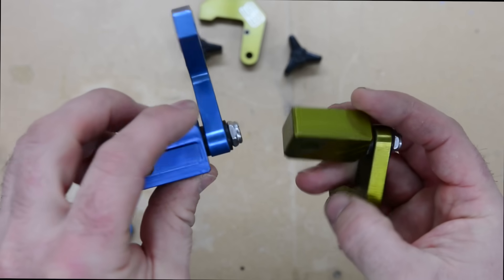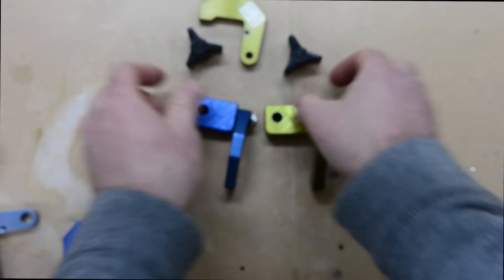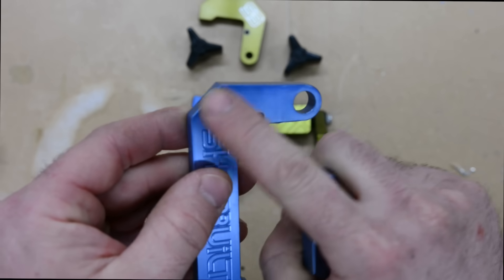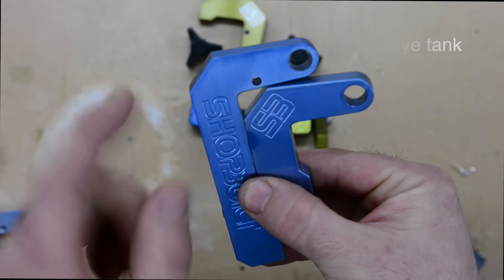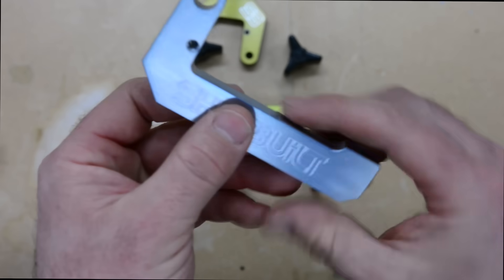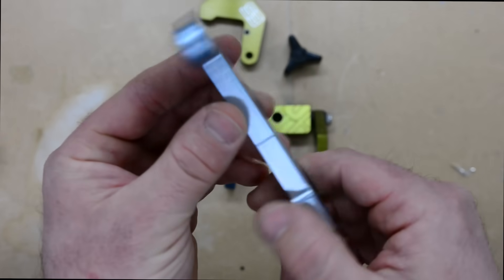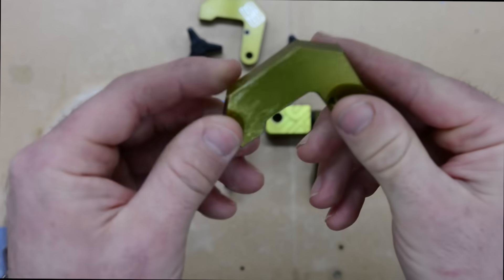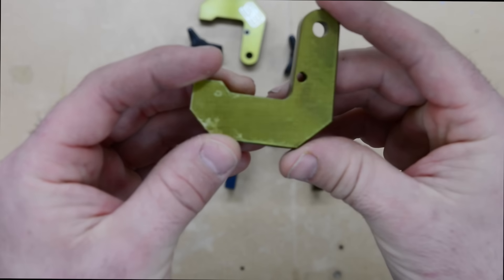Make sure you let me know in the comments which color you like more. I think I lean more towards the green, but the blue is really nice too. Troubleshooting: I got a dark spot right here, and same thing with this along the edges - that's probably due to the dye tank temperature being too hot. If you cool the dye tank and leave it in there for longer, that should fix that problem. This one here just didn't anodize - it didn't take the dye at all, not really sure what happened. And this one here is probably leftover acid from going from the battery acid to the dye tank. Really want to make sure that part is rinsed well before it hits the dye.